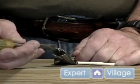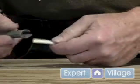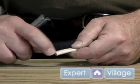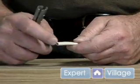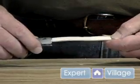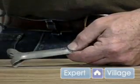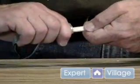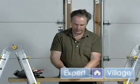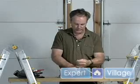You can just see it hanging down from here a little bit, so that when we actually put a wire in here, it will cut right down the center of the wire so it won't cut either of the conductors in it — it might touch the ground wire. So we just put it in here, squeeze it down. Now that little razor's gone into the wire, and as we pull the wire through it, it cuts through.